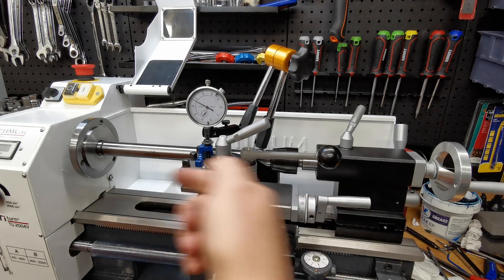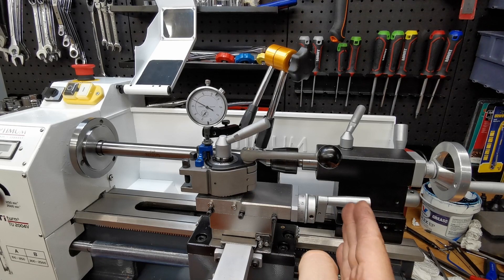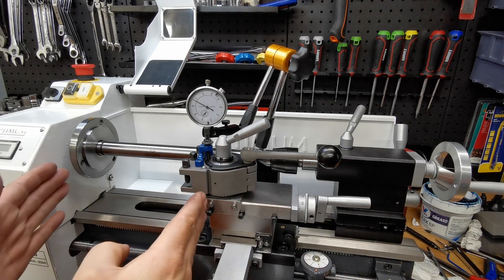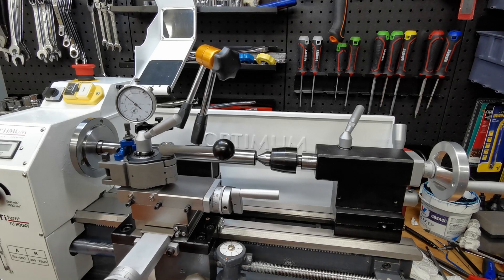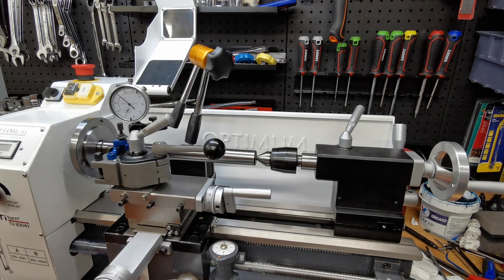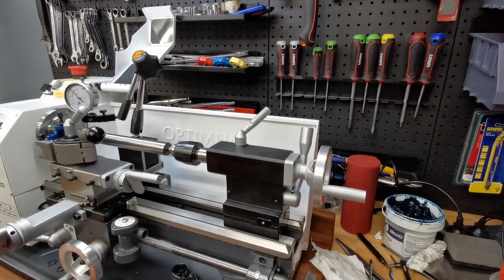But when I matched it up, which was down this end, it was with the tailstock in at an inch and at two inches — so again, that was here in this first bit. And in fact that first bit there is actually quite good. So does the table drop off at the rear, or does it actually all need to come up and then be pointed down slightly? I'll have to keep thinking about this — it's insane how many variables there are in this sort of thing.